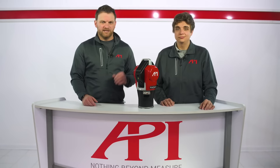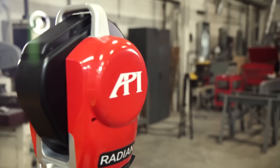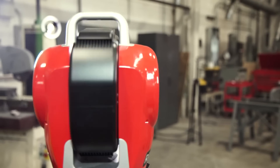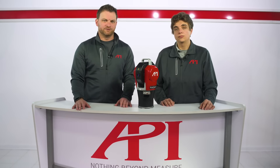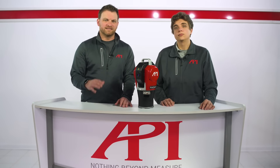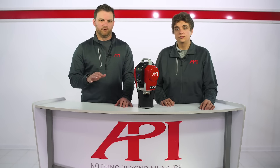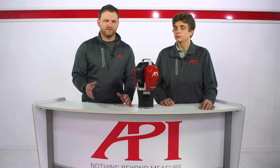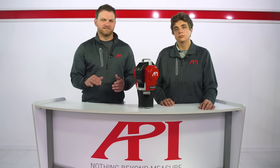The first and most obvious component of the laser tracker is the laser itself. The laser is sent out of a main port in the tracker to a target which reflects the beam and returns it back to the tracker. These lasers, like the Class II Helium Neon laser that Radian Pro uses, send out as many as a thousand points a second, and the velocity of these points, combined with the time it takes for them to return to the tracker, is how the X value of the linear distance is calculated.